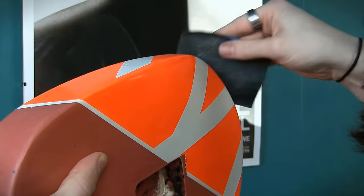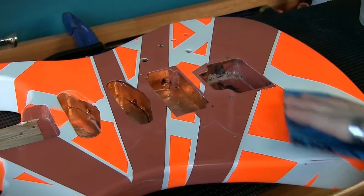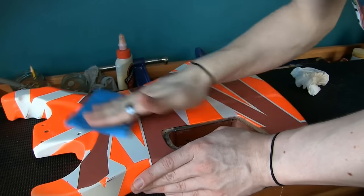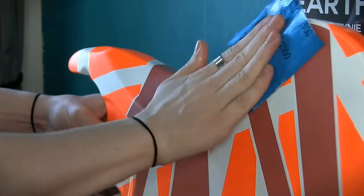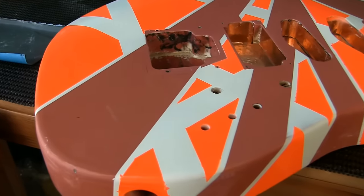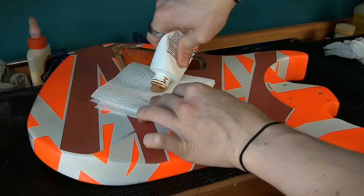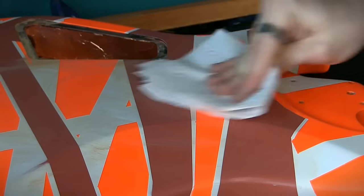Although I've left this for the best part of a month, the clear is still somewhat soft. Ideally it should have sat for longer before this process, but we've all already waited long enough for the resolution of this series. I've long given up any hopes of this project turning out perfectly. At this point the finish is pretty matte. If we wanted a high gloss, we would use progressively finer polishing compounds to buff the finish until very shiny. But I'm just going to go over the finish with this coarse compound to smooth everything and give it a little shine. I don't want to make it too glossy.